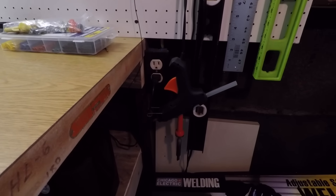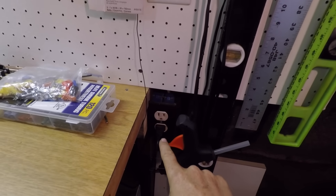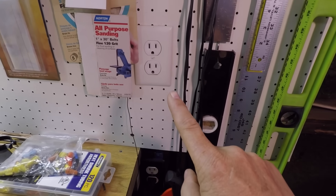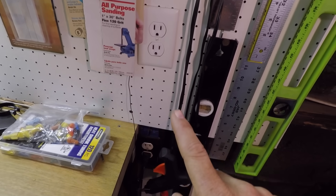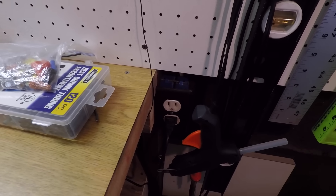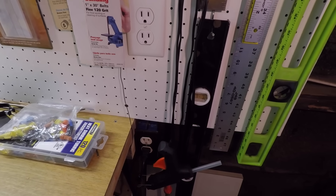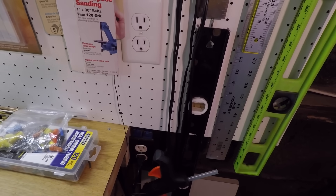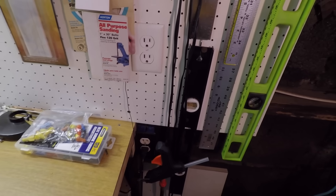A while ago I did a video where I put in several outlets right above each other. I've got one down here with a brown cover on it, and then directly above it I have another outlet. The whole point for me putting these two outlets so close together is they're on separate lines — both 20 amp circuits with 12 gauge wire. I'm going to make a device called a circuit combiner, and they do make a commercial version, but I'm going to make my own and that's what this video is all about.